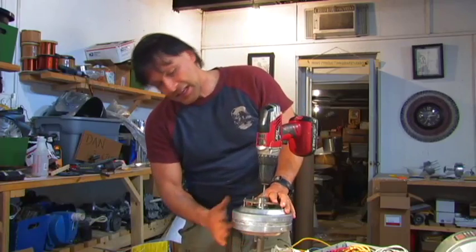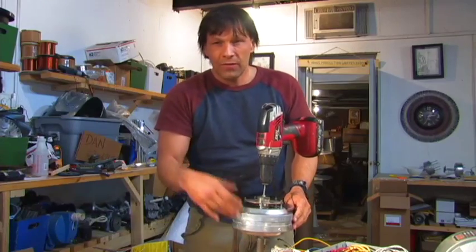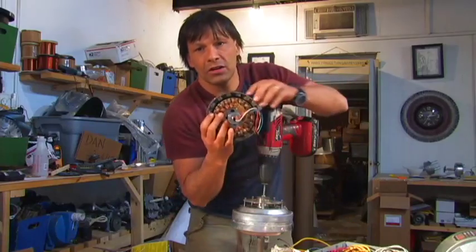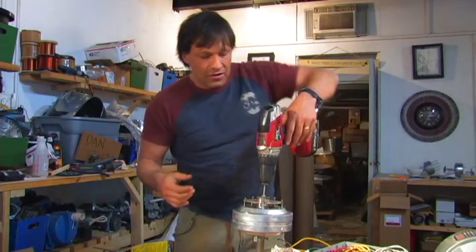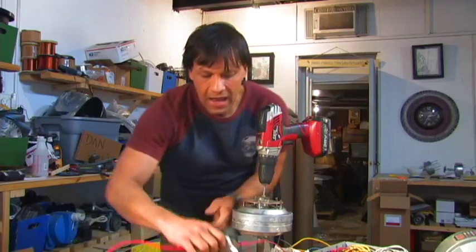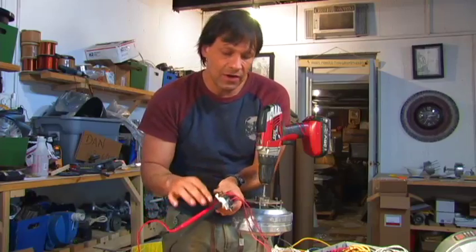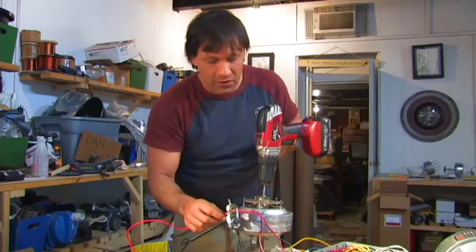Hello, I'm your host Dan Rojas. I have one of the ceiling fan conversions hooked up — a ceiling fan motor with neodymium magnets replaced around the outside. If you don't know what I'm talking about, there's a link below showing what these look like on the inside, and a link to a channel where someone builds a lot of them. This particular one produces very high voltage. I have it hooked up to a regular AC outlet, which is a very unsafe way of doing this, but for this test you'll see why.